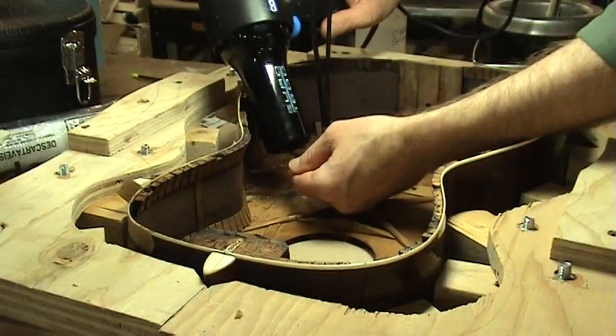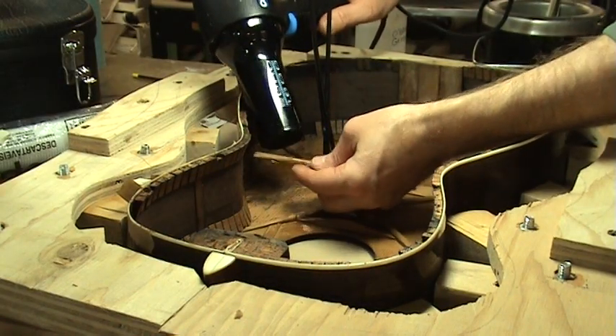The advantages far outweigh the disadvantages. Another potential problem is the open time — the glue must be applied while it's hot. One way to extend the open time is to dilute your mixture slightly; however, I don't recommend that as it weakens the bond. The best way is to heat your shop — make it hotter — so it takes longer for the mixture to gel. Another way is to heat the pieces you're going to glue together, which also extends the open time.